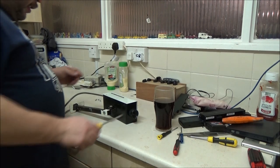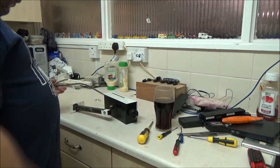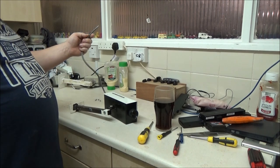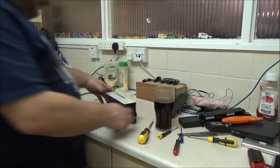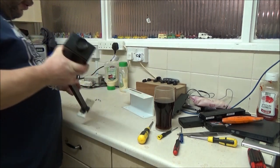That's not the way I would do it myself. The way I would have done it is, where this would have been mounted, I would have extended this, but I would have had this clipped up the wall and go into the ceiling. Just drill a little hole in the ceiling and just poke that up through it — same with the RF socket — so it looks a lot more convincing.